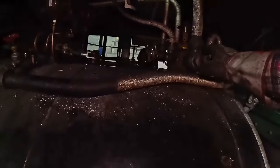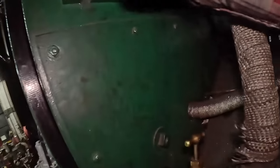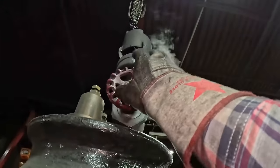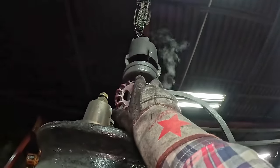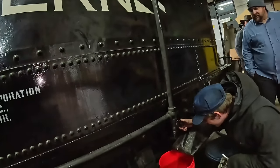though. All right. Verify other injector off, blower off, hydrostatic off. And now we shut the turret itself. I'm going to want both hands for that because it's kind of awkward. All right. Turret shut, so all of our appliances' individual valves are off, and that main shut off. Now we climb out the cab door, and we shut off the loud thing. And that's off. Always a graceful process. It'll melt more as we close the doors, I guess.